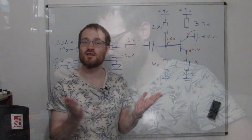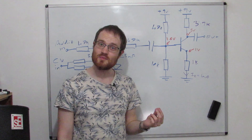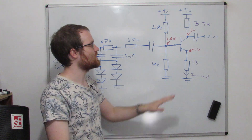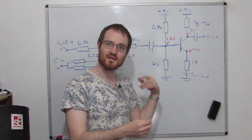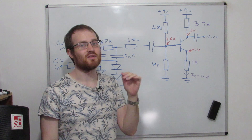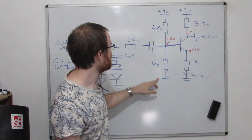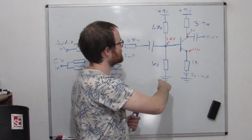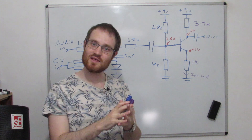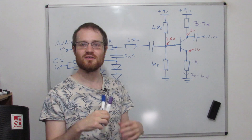So we're going to try to increase the input impedance of this transistor amplifier, and what we're going to try first is something called bootstrapping. We're going to use some positive feedback from the output of the amplifier — feeding some of the output in-phase back to the input — and that's going to increase the input impedance. We're going to have one network to do the DC biasing and a completely different network that handles the AC circuitry.